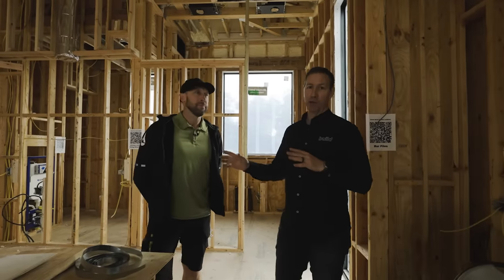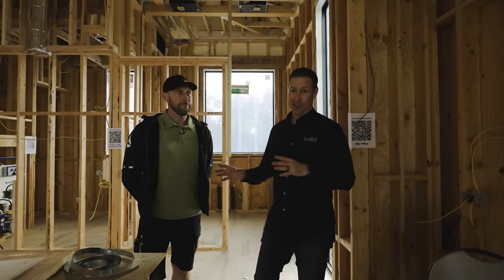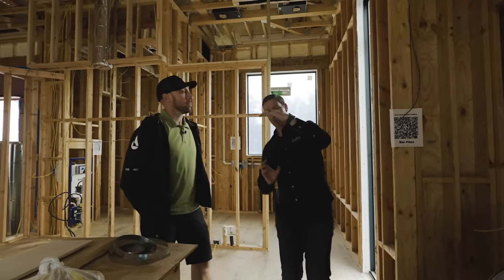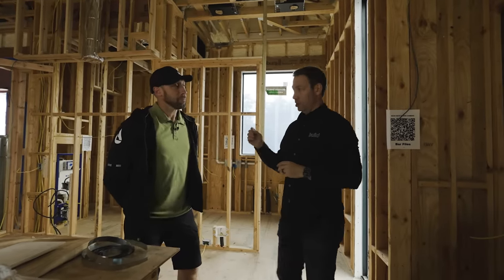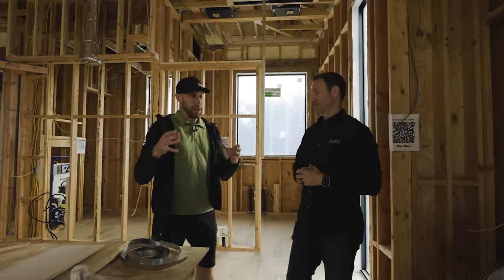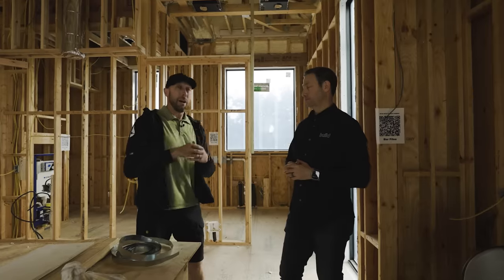Guys, if you don't know Travis Brungart, he's with Catalyst Build in Kansas City, Kansas. He is a master electrician, holds a mechanical license, and he's done shade pockets on his jobs before. We're talking about this box up here, which is going to be a spot to recess those shades or blinds, depending on what you call them. Travis, talk to me about what you need to do for pre-planning for these. Oh my gosh, so much. You've got to have the material selected — knowing what manufacturer the client or the architect is going to specify. That's the starting point to know the size you're going to need, the shape of the box, how deep, all those things.